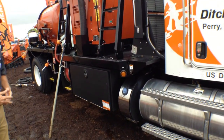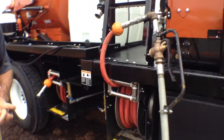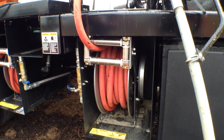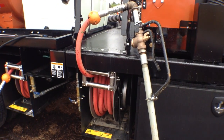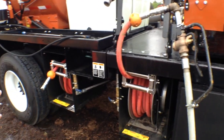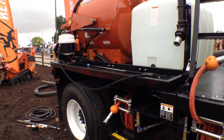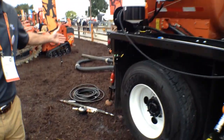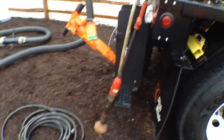These systems come complete with air hose reels depending on the performance level of the air system. We've got a 10-series air system that's 200 CFM and 200 PSI. When you jump up to a 12-series, that's 300 CFM and 250 PSI. Both series come standard with a dual pressure switch that allows the operator to shift the maximum pressure down to 100 PSI, so that we can use pneumatic tools like jackhammers, tampers, moles, or any other pneumatic tool that a customer would have on the job site.